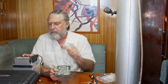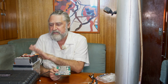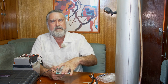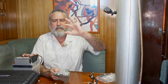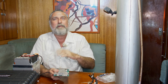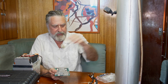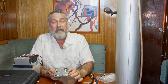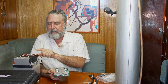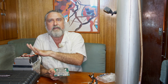As you probably know, lithium iron phosphate cells can be damaged in so many ways. You've got to be very careful with them. That's this guy's job. Most BMSs only watch that they hold the cells within a voltage tolerance. Some go a little above and beyond. This one will watch the temperature, and it has temperature probes. And if the temperature goes below freezing, it will stop the ability of the cell to take any more power. So if you try to charge it, it just won't go in the cell.